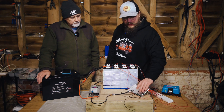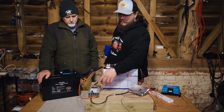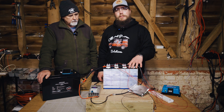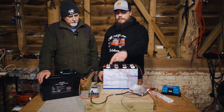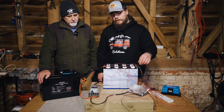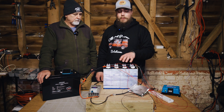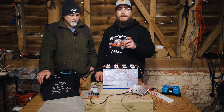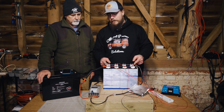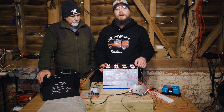We've put a JK BMS onto the battery, connected it all up, and put a charger on — charge is busy cranking out 50 amps. So we're going to get it fully charged to 100% state of charge. We'll probably initially do a capacity test with the BMS — just connect the tester to the negative and positive wires here. We might even do a capacity test of each individual cell afterwards to see how they do and whether there are any outliers. One of them was shorted a bit, this one here, so maybe it's lost some life.